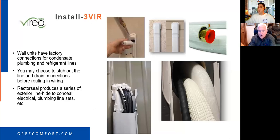Yeah, so what you're pointing out is that the room temperature sensor is directly, if you're turning the lines directly and going through the hole, your room temperature sensor is right in front of that hole. So if you don't seal it, it's coming right onto that sensor and it's not getting true ambient temperature to get accurate control. It sounds like you've seen this happen before. Yeah, a lot. It's pretty common.